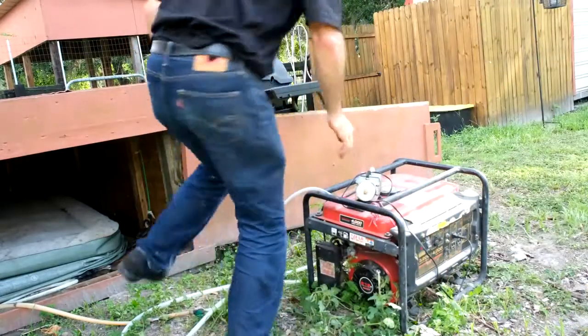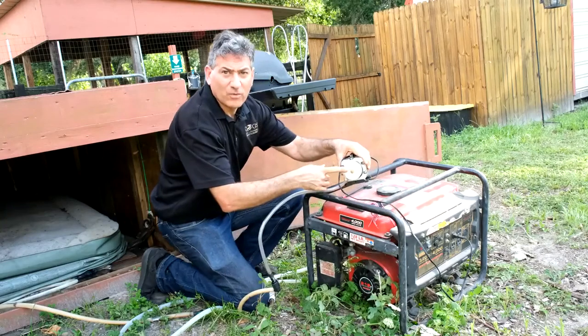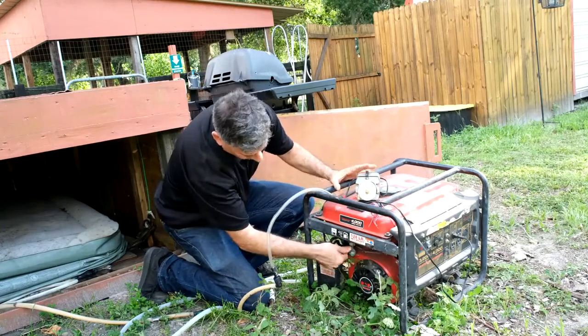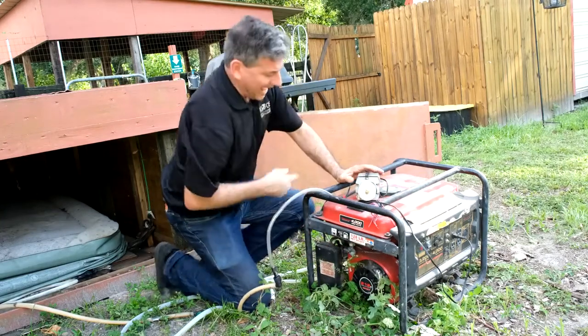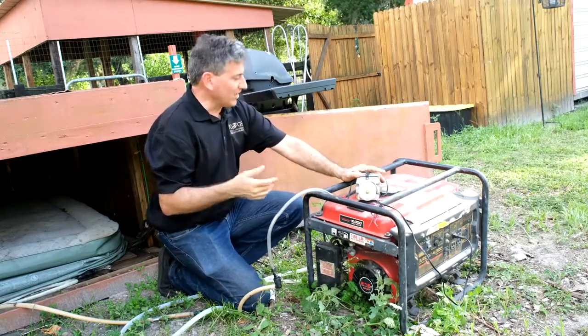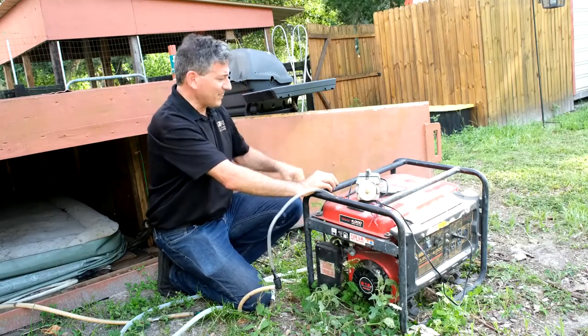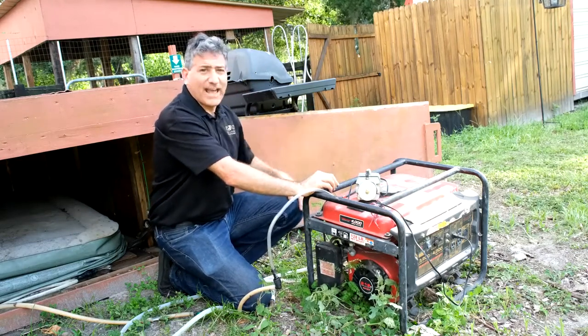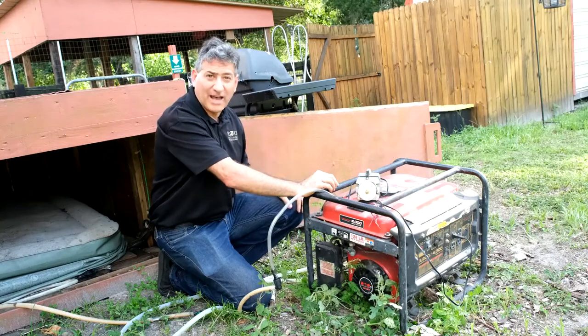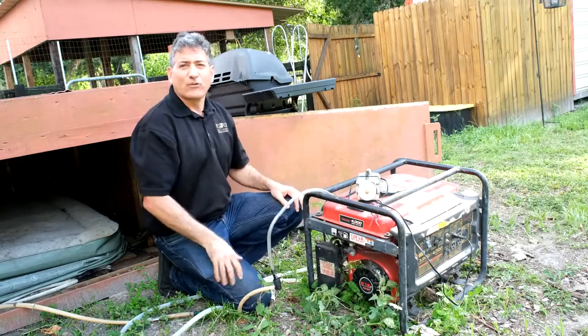Once it's started, the pump is running, so we're good with that. Then turn off the gasoline, and you'll hear it switch to biogas. You'll also see that it's smoky when it starts, but then once it switches to biogas, all the smoke is gone and so is the smell. Biogas is clean burning — it turns into carbon dioxide and water vapor.